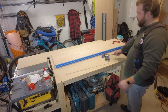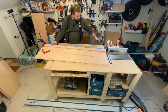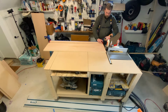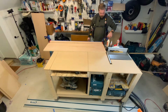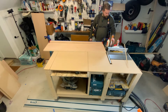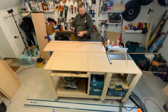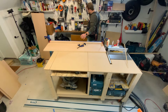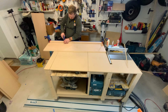Clamp there. You ever feel like doing this? Any sort of woodworking, really, just invest in some of these clamps. Quick clamps. Good enough for beginners. If you get into the more serious sort of cabinet making, you will probably want to invest in some cabinet clamps. They just have a larger surface area, and they are less susceptible to bowing when you clamp something really, really tight.